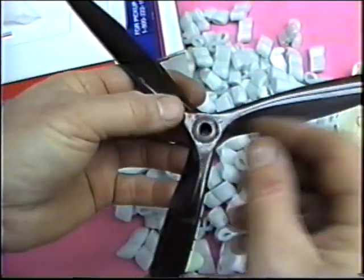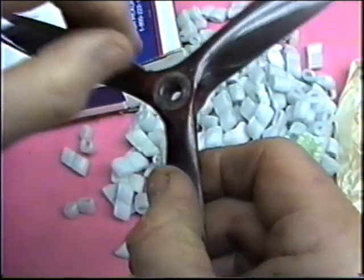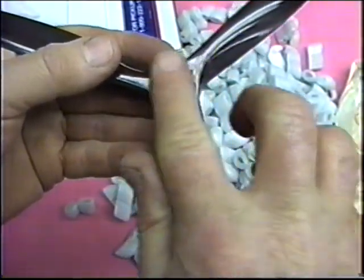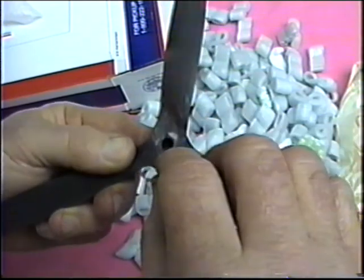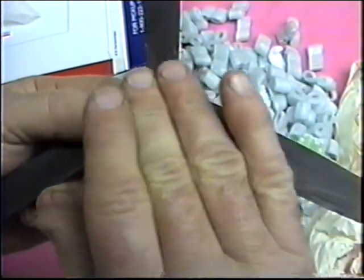Now, one of the things I remember from having these props, see this has already been on an engine, of course, but see it has a little lip here. So the first thing I want to do is machine this flat. I don't want this lip sticking up. And then I want to roughen it up. Now, did George roughen this? No, I didn't. I want to roughen up. See, this is not perfectly flat either. I want to get this perfectly flat.